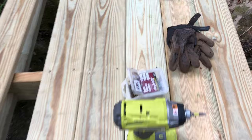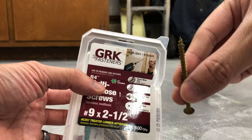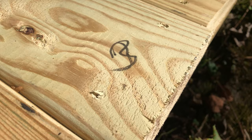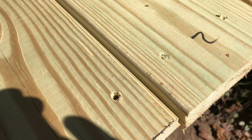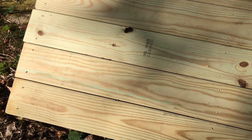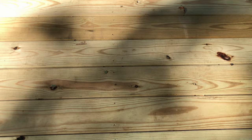I started screwing the decking boards from the center and moved my way out toward the ends. The screws I used were number 9, 2.5-inch GRK screws. They are multi-purpose and rated for indoor-outdoor, including pressure-treated wood. You don't want these rusting, so make sure you get the right type of screws. Going back on the wet wood, you might also need to countersink the screws a little bit more than usual — about 1/8 inch deep — so that once it dries, you don't have screws sticking up and popping your tires or tripping you. For each decking board you're going to have 6 screws: 2 on the left, 2 in the center, 2 on the right. In total, I used about 126 screws for the whole project, including the blocking and stringers.